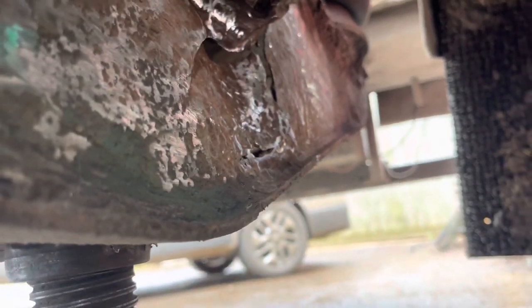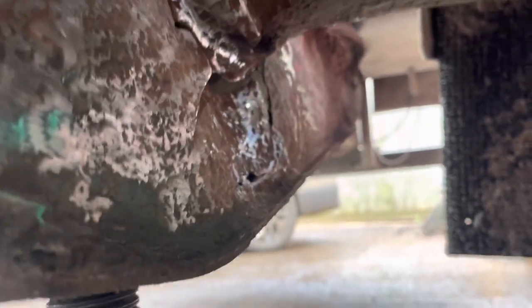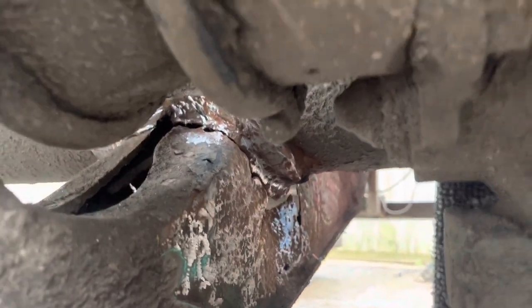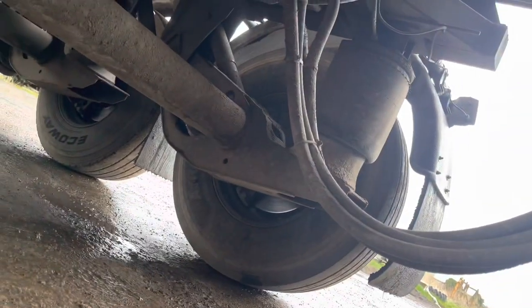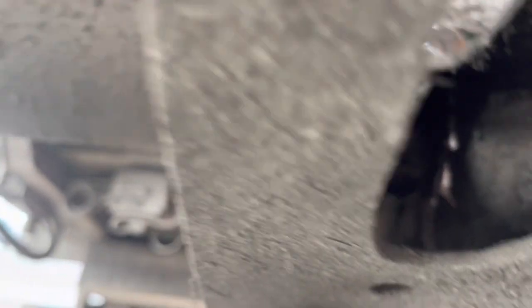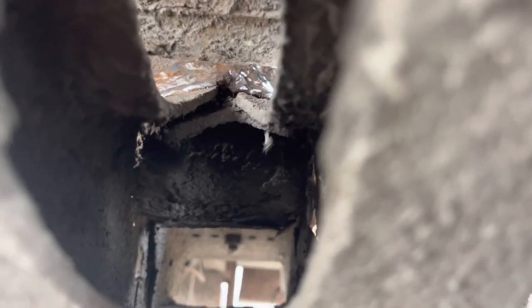What I'm going to do is just tack it up and best I can try and pry it out, fill the gaps, and then we're going to put a strengthening plate right over the top of all of it, inside and out. Then go around all the other axles and just have a little check, make sure there's nothing on any of the others. But this one is pretty bad, so let's get to welding that - buzz it in.